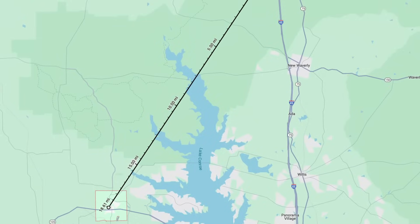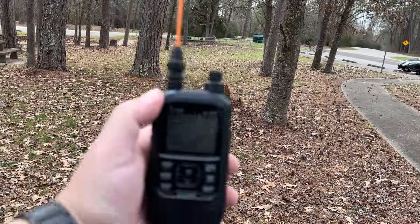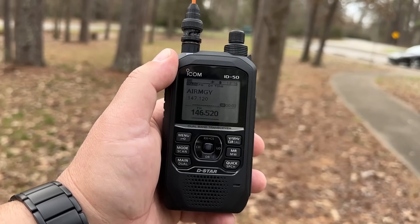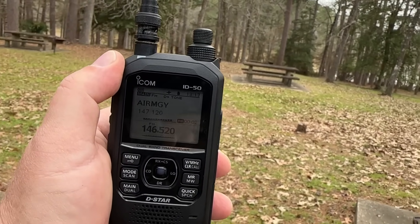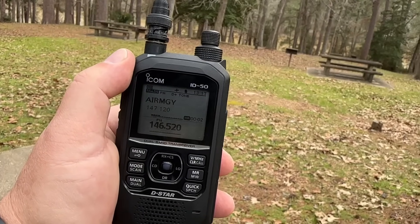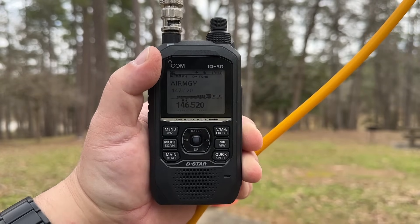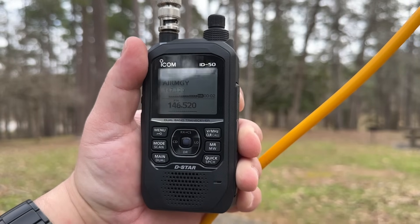Here's another repeater, about 19 and a half miles southwest of me. With the signal stick on, I'm receiving it but it's kind of in and out — you move around, you're in the sweet spot and then you're not. It's totally gone. But with the Faraday J-Pole, we get a beautiful full signal. Fantastic.